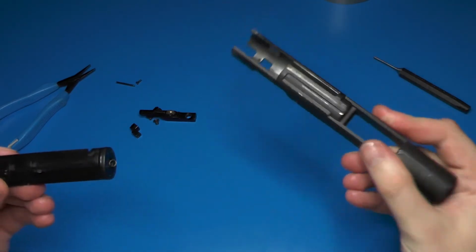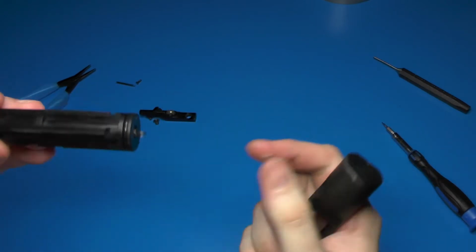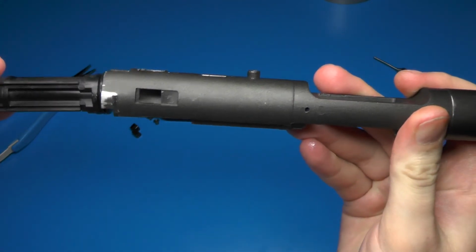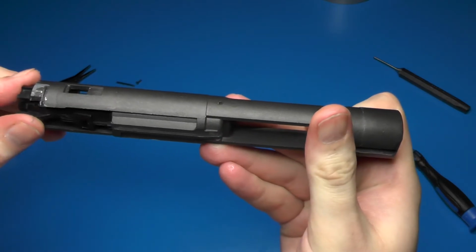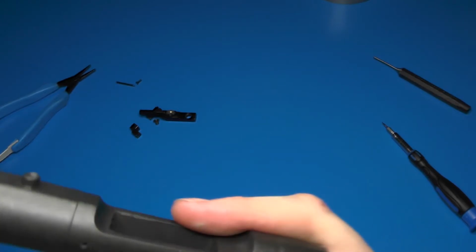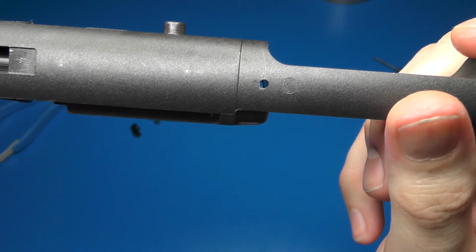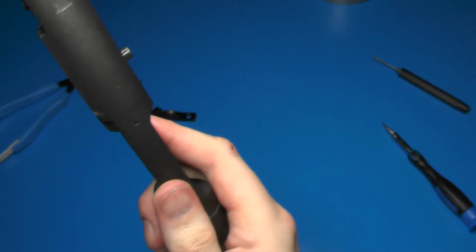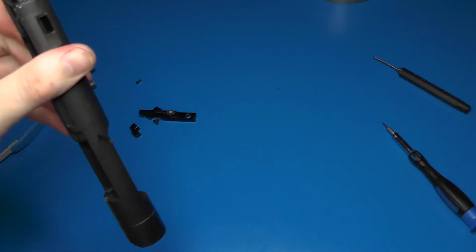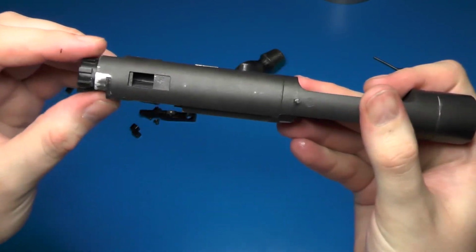So next up, we're going to put the nozzle into the bolt carrier, and this spring loop will sort of self-align with the pin hole. So you just slide it in, go all the way back, you can see the loop coming in the back. Let's see. You see there? Right there is the loop, so we know we're close. Get the pin started. And again, hope for the best, and I managed to hook it on the first attempt.